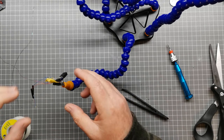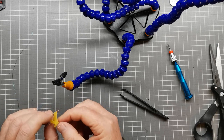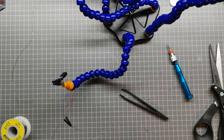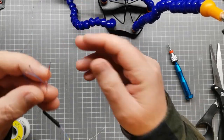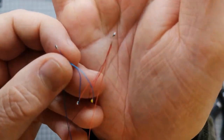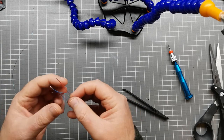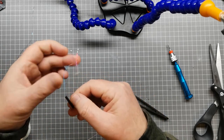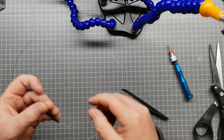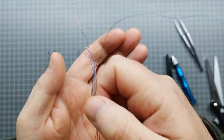When you're wiring LEDs, you don't want to sit the soldering iron on the wires for a long time — get the heat in quickly and then out again because they are sensitive devices. You really don't want to overheat them by putting lots of heat through the wire. So there are actually four positive leads all joined up together: three from the LEDs and one from the lead going out. I'll do the negatives off camera and then come back to show what it looks like once it's all soldered in place.